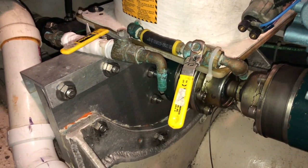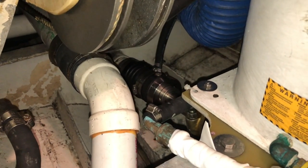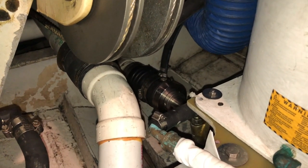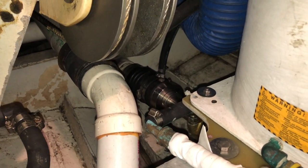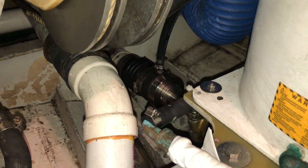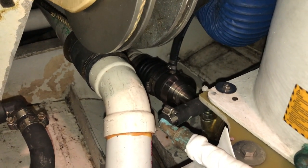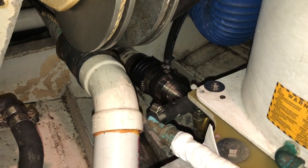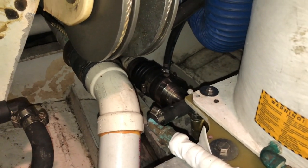The shaft is Aquamet — about four years old. The previous one got scored by a defective cutlass bearing, so we replaced it. We probably could have filled the score with weld and had it polished, but we don't do things that way on this boat given the kind of places we visit. The engine mounts are very soft mounts provided and engineered by AquaDrive in Germany — you send them the specifications and they engineer the mounts. You can move the engine intentionally just with a hand. The soft mounts stop any vibration going into the boat because you're not absorbing thrust from the shaft — that's taken by the thrust plate.